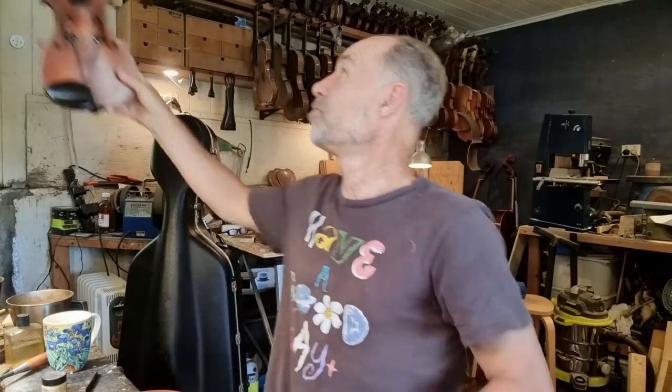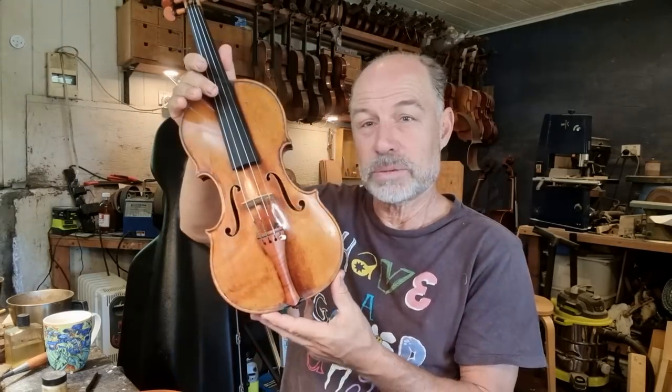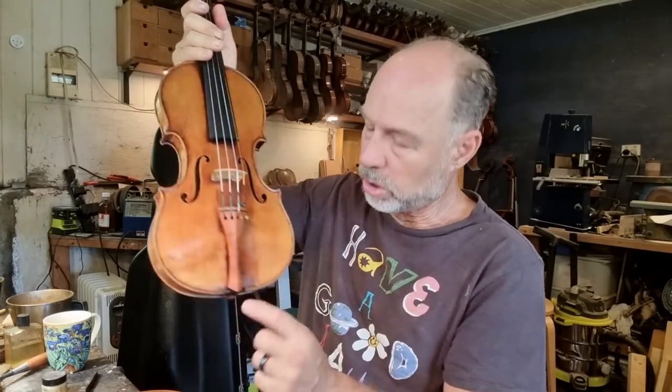The Smith violin came back — it had some problems with opening joints. The varnish used on this instrument... I believe some English makers did that. To make the timber look really beautiful and old, they may have soaked some of the timber in turpentine and linseed oil. That actually makes those areas very difficult to glue — the glue doesn't hold and they end up coming undone very easily. We've had some very wet times, and so again it had a buzz. This time it was the bottom block that had come undone.